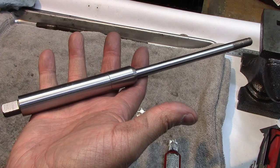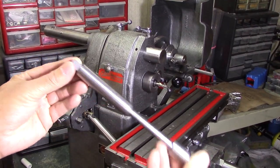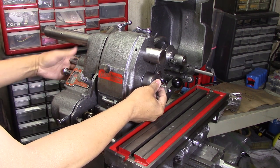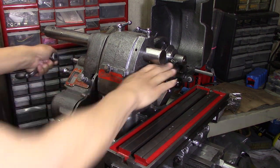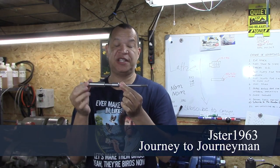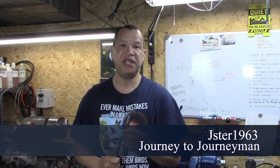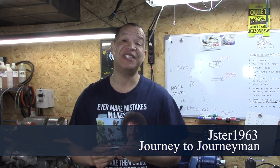Let's put it on the correct machine. Now that I have made this drawbar, it is easy peasy with the spacer — easy to get this in, get her tightened up, and now she's ready to go. Lessons learned on this little project: it was a simple little project — single point threading. I watch these guys that do it all the time and they're just zip zip zip. But if you're like me and just do this every once in a while, you have to do it step by step. And also that high-speed steel — a perfectly ground high-speed steel tool on these small lathes does an absolutely excellent job. Thank you for watching, I hope you enjoyed this and I hope to see you on the next Journey to Journeyman.